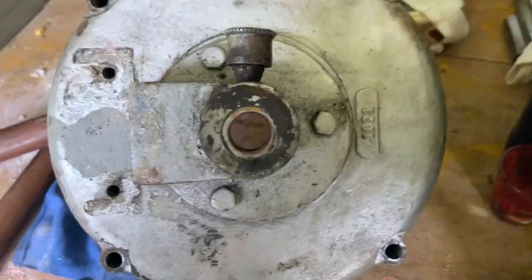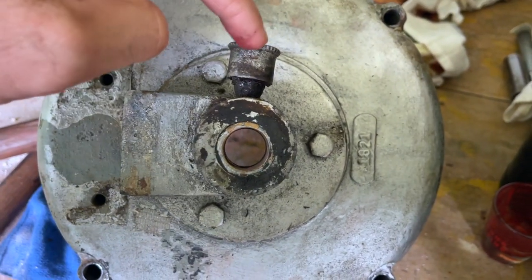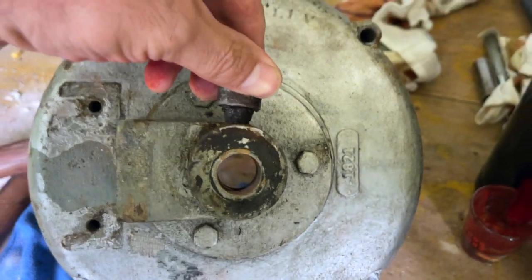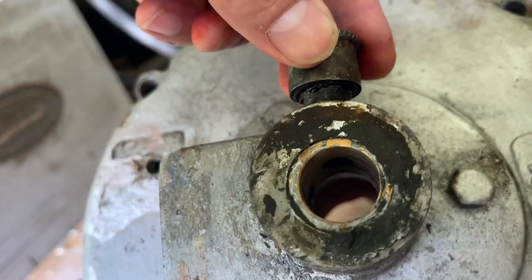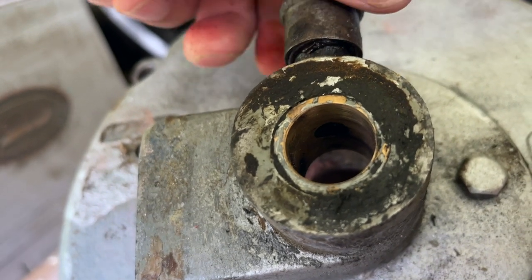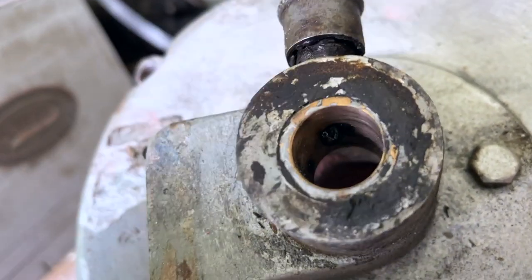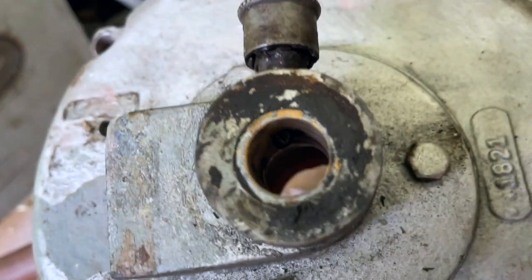I want to show you a grease cup. This screws off and it's just a little cup - you put the grease inside, screw it back down. Every so many hours of running this mill, you just walk over and turn the grease cup a little bit. It's got a hole inside that goes up into the grease cup where the shaft is. When you turn this, you can see the grease come out - that's how you grease and keep these bearings greased. Just turn it maybe an eighth of a turn. That's how it works.